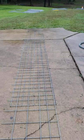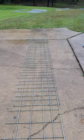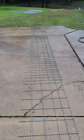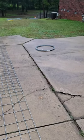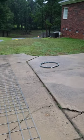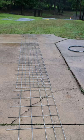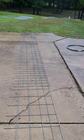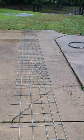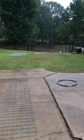By overlapping and tying them all together, this basically becomes one single unit once I'm finished. I'll cut the pieces, lay them out where the wall will be built, and use the nine-gauge wire to tie it all together. Once the bottom and two sides and ends are done, I'll fill it with rock, then put a top on it following the same process.